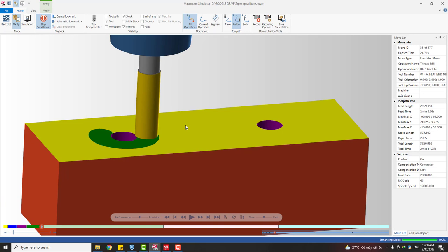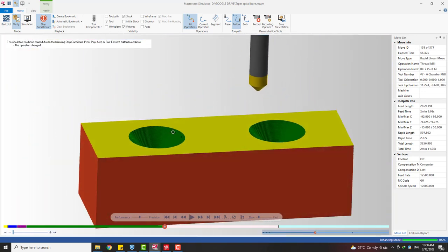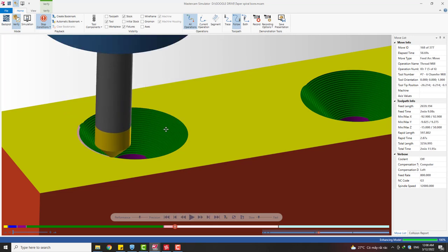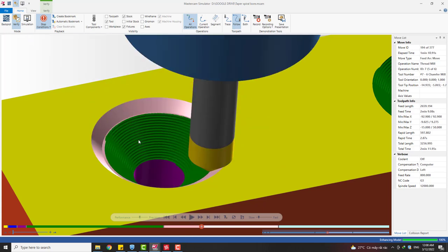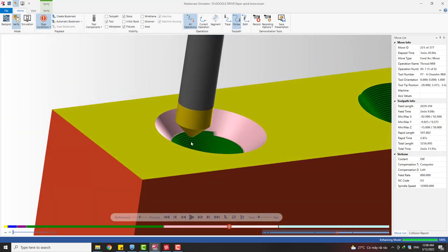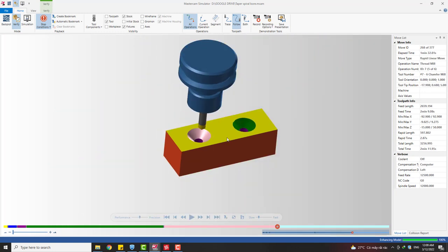this is the flat end mill we use for doing the roughing cut. Yeah, and this is the stepped surface after the roughing. After that, I come with a chamfering tool, a flat tip chamfering tool. Go from the top to the bottom, go like this. You can see we still have a lot of material here. This can affect the surface finish, so you need to try on your machine to see what value is the best. Okay, it's quite a very fast step down. If you have a good tool, you can go very fast step down, and you can keep a good surface. Yeah. Very nice.